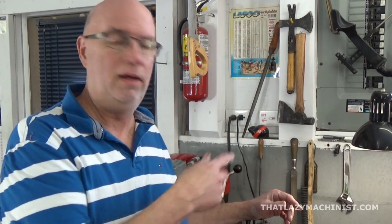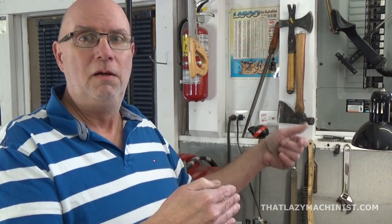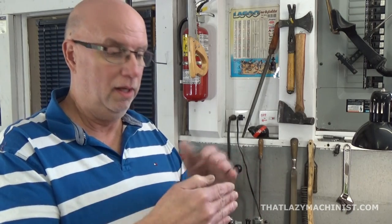So all I have to do is bring my dial indicator back onto the side that we've just offset, find its 0, ramp off, turn the part 180 degrees, or turn the chuck 180 degrees, and come back. I'll be far away from the part, on the other side of the offset. But all I have to do then is move the part in the 4-jaw chuck to make it come back in contact with my dial indicator to get that same 0 as I had on the other side. And I'll be at the same spot, but opposite to where I was before.